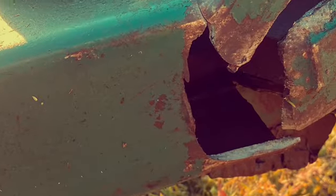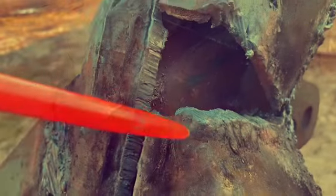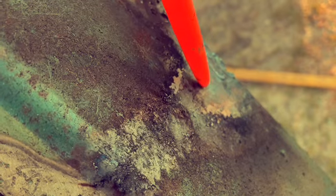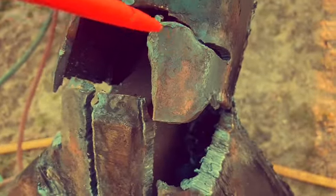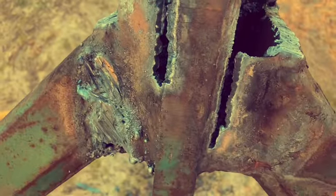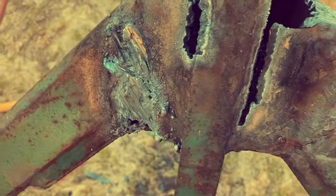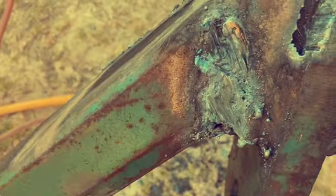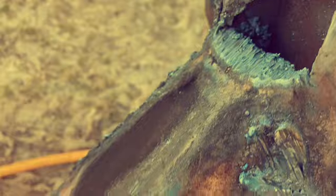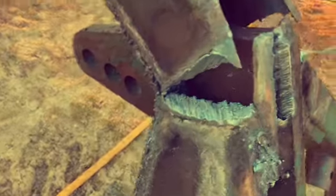Pulling that aerator in highway gear done got them in trouble. I've tried to find every crack and every weak spot, cut it out. There's another crack right here that we're going to have to get to where we can fold it back together. Went ahead and cut these cracks here and here. That was just really ugly. I don't know if they was having welder tryouts or what. They built most of it with a squirt gun, and then they swapped to a stick.